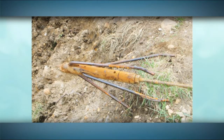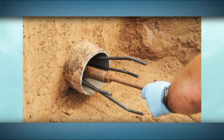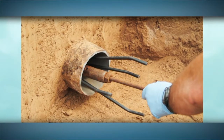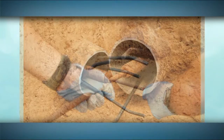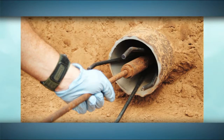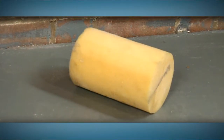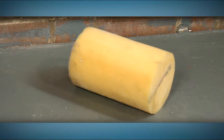With power boring, high tensile steel rods rotate along the interior surface of the pipe while a constant flow of water helps wash away the tuberculation. Once the pipe has been cleaned, the rods are removed and the remaining water and debris are flushed away by blowing foam cylindrical swabs through the pipe length using filtered compressed air.